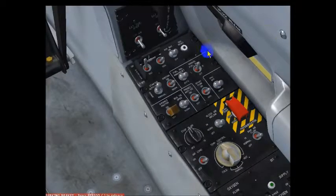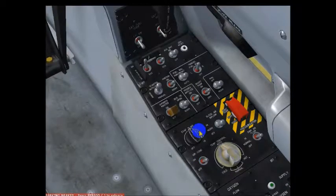As we come down here, you will notice a flow pattern. Flowing like this, like this, like this, just like you would read, really. So this cockpit flow assists us in just knowing where to look for our switches as we read through the checklist. Chocks removed, generator switch is in the off position. All right, we come down. Now it is a little choppy, but we go down to this next row. Fuel balance, because we're going to come back to this later, but fuel balance, manual reset. Okay, we can have it in manual. We can have it in the auto position. They want this in the auto position according to the checklist.